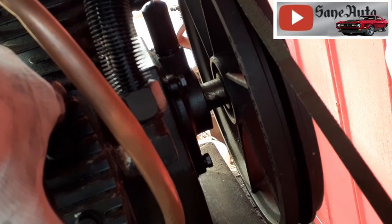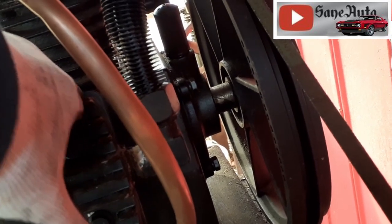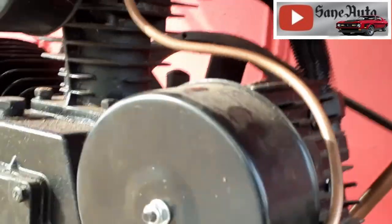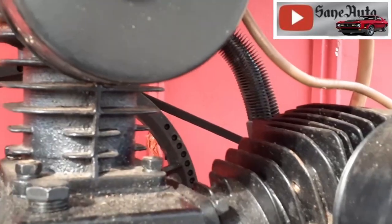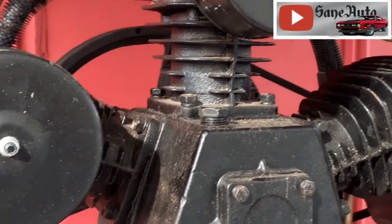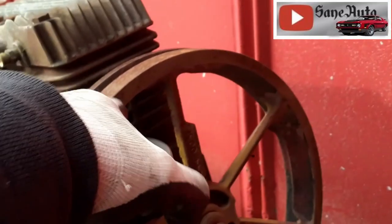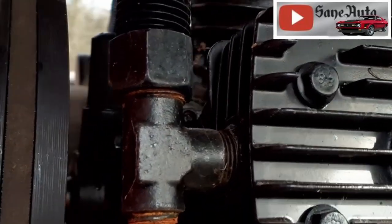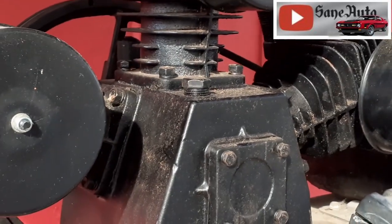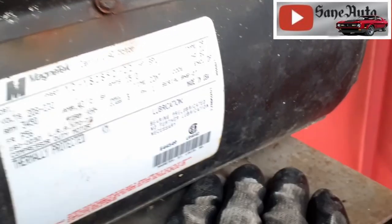All right. And the old pump that came off of here was rated around 1200 RPM, and so is this three piston pump. So 3,450 RPM from the motor, 1200 RPM pump, and this flywheel is the same diameter as the flywheel that came with this 3-piston pump, so we should be very similar in RPMs.